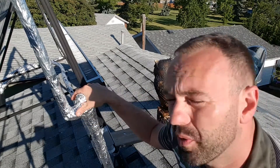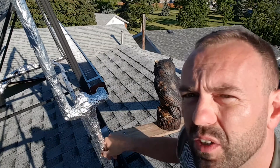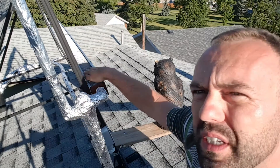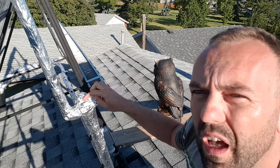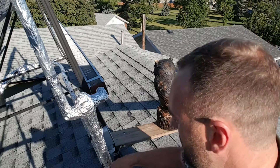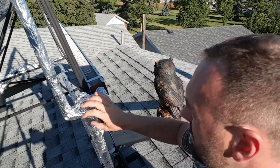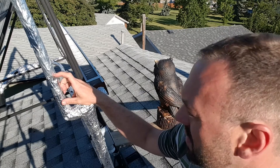This three-way valve is a very special three-way valve, as it's set to make sure that the water coming out of here never goes above 80 degrees Celsius. If the water coming out of the panel is higher than 80 degrees Celsius, then this valve will open up a port which will allow some fluid to come through this back pipe right here — which is also connected to the inlet — travel into the three-way valve, mix, and then travel down to the solar storage tank at no higher than 80 degrees Celsius. If the water is lower than 80 degrees Celsius, the valve will just allow free flow down to the tank. So this only kicks in a sub-stream of flow if the temperature in this pipe exceeds 80 degrees Celsius.